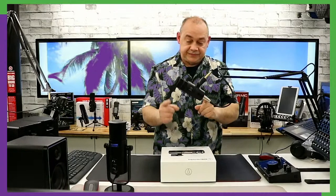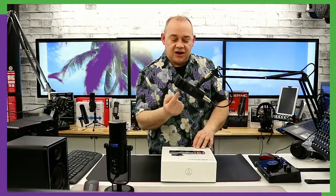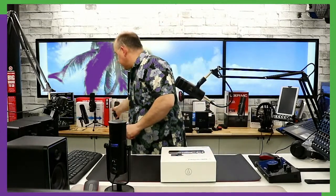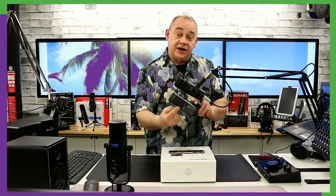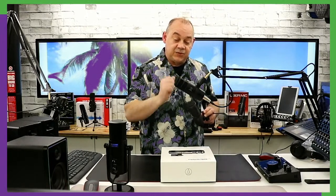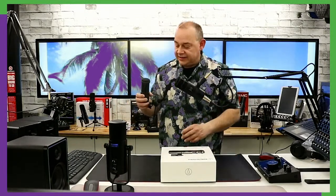Okay, so this is the microphone. Normally we see microphones like this. They're condenser microphones and we talk off to the side, kind of like the AT2020 that we had before. So these two microphones look very similar. With the AT2020, you talk in off the side, it's a condenser microphone. This one is a dynamic microphone, so you can throw a lot more gain into it. It is more protected from outside noise. And the most important part, because it's dynamic, it's not going to catch that big noise far away that you hear on your condenser microphones all the time in the background. If you're in a noisy environment, condensers can be problematic. You could be doing a lot of noise suppression after the fact.